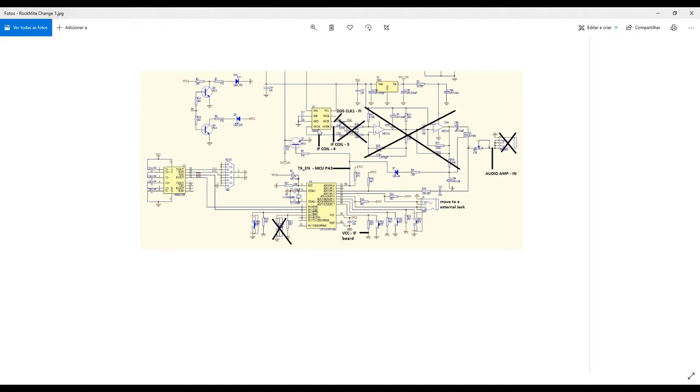455 kilohertz. It's interesting because now I move my information to different areas, okay? Far away from each other. So now you have the 455 kilohertz here, and the other information is in another part of the spectrum. And when you are now filtering this information to your audio amplifier, you will not listen to this other part of the spectrum, this other information.